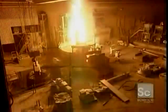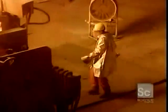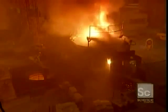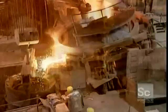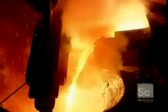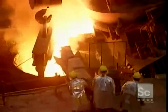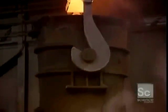Throughout the 3.5-hour meltdown, they test and adjust the chemical composition. They try to attain the lowest hydrogen, oxygen, nitrogen, and sulfur levels, the key to producing strong, high-quality steel. Then they pour the sizzling molten metal into a 50-ton ladle that's lined with heat-resistant brick. They add aluminum and lime to chemically counteract oxidation, rusting caused by air exposure.